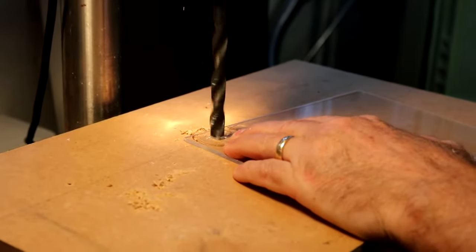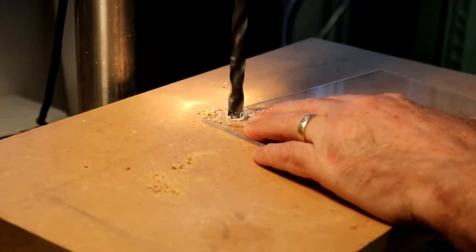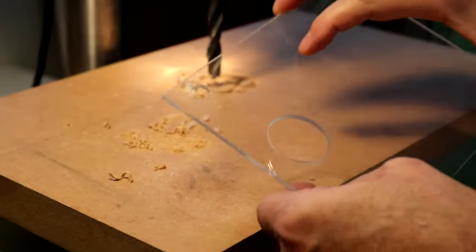Here we tried using a handheld drill on the plexiglass for the hydration chamber. We just couldn't do it - we tried slowly stepping up the drill size and as you can see it just didn't work. It ended up cracking a little bit, and when the crack started to appear we stopped and switched to the large drill press. With the big drill it worked flawlessly. If we had continued with the handheld drill we would probably have broken the whole side; instead we only had a little crack around the hole.